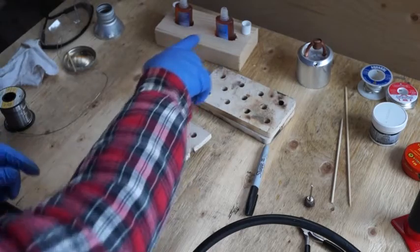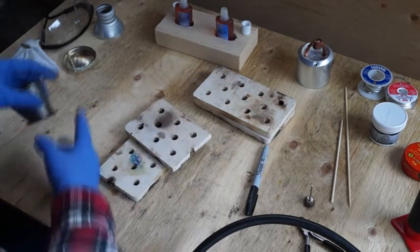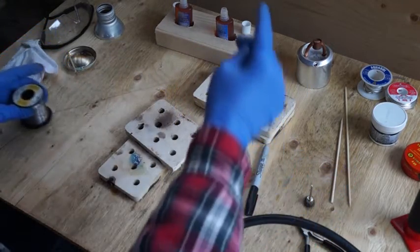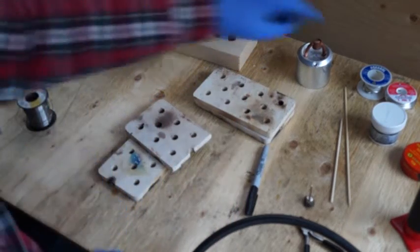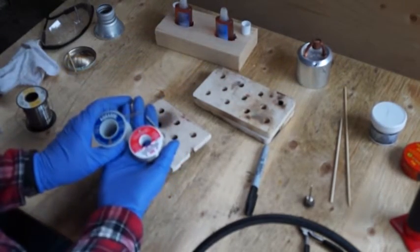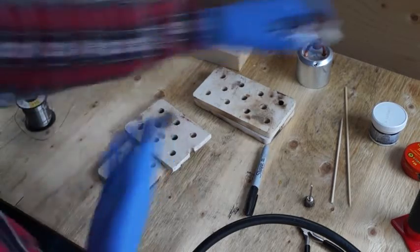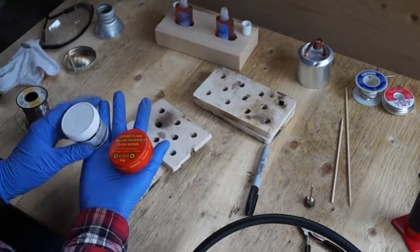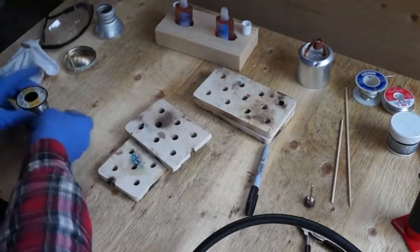The other one, F61A, works from 180 to 250 degrees, so I thought I would try it for a different type of solder. The solder I'm using is for electronics and it has tin and lead in it, at about 183 degrees Celsius. I thought I might try solders used for drinking water — they're lead-free — but I couldn't make it work with that type of solder. This flux really likes lead.